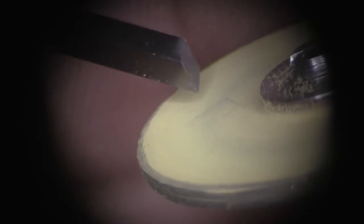There are 3 steps for sharpening the engraver. First, we do the face of the engraver. Again, it's a 45-degree angle, and you sharpen the face of the engraver. Then you start putting in the heels, at about 15-degree, 30-degree angles this way and the other side, and then we give it a little bit of a heel on the front.